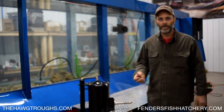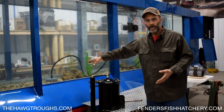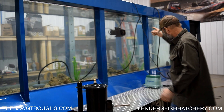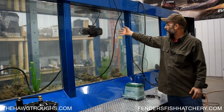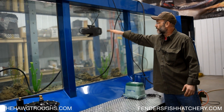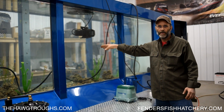We've got two different types of aeration we typically work with: surface aeration and bottom aeration, and that pretty much speaks for itself. With bottom aeration, it's typically always an air stone like you see in the bottom of this tank. You push air down through an air line from an air source, it pushes air into that air stone, it breaks up into a fine mist of bubbles and travels to the surface. Or you have surface aeration like this, which is typically a float with a pump hanging off of it — that pump pulls water in, shoots it up through a nozzle, and changes spray patterns for different effects. This is working off the upper couple feet of water, and if you have a body of water more than six or seven feet deep, it really isn't going to do a whole lot for the bottom of the pond.